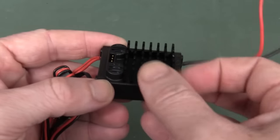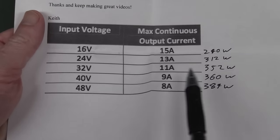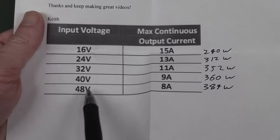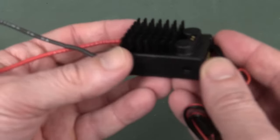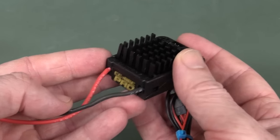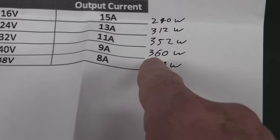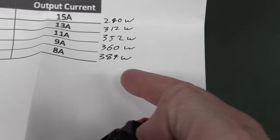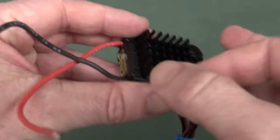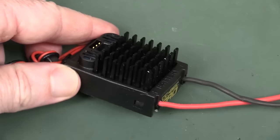Are you kidding me? Even if you're 90% efficient, you might be able to get higher if you optimized it for one particular output voltage, but this is a fairly wide range. If they get 90% efficiency in this thing, they're doing really well. It means you're going to be dropping anywhere from 24 watts to 38 watts in this pissant little heatsink here. I call bullshit right away. And I had to double check.